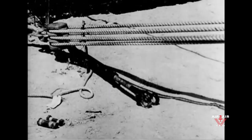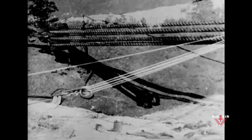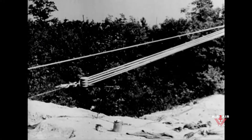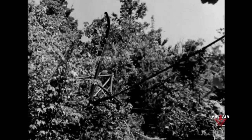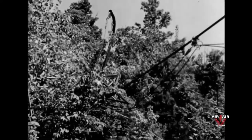Block and tackle are fastened on the bridle cables, beginning the job of raising the runway. Teams work at each side, pulling together on the two bridle cables so that each of them shares the load. When the runway is a few feet off the ground, the lift lines running through the fairleads are checked.